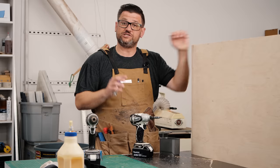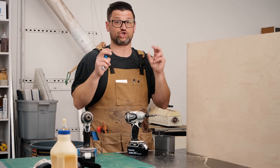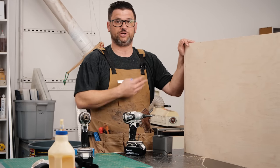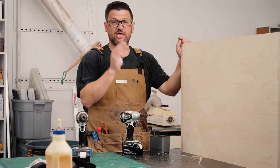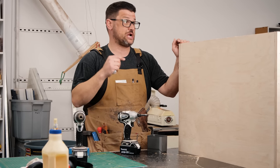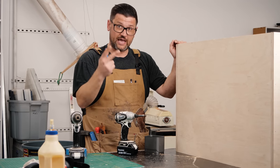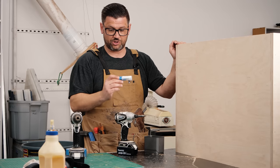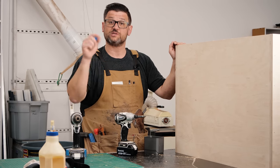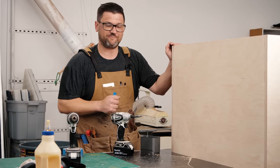We're going to put our back on, and this is what's going to give our cabinet the rigidity it needs and ensure it's square. With plywood you should already be square, but just in case this is your last chance to bring it into square. To make sure we're nice and rigid and square, we're going to use glue, nails, and screws. I'm going to use this really cool countersink bit from BitsBits — there's a 15% off discount code in the description. Let's get this put together so we can finish up the cabinet.